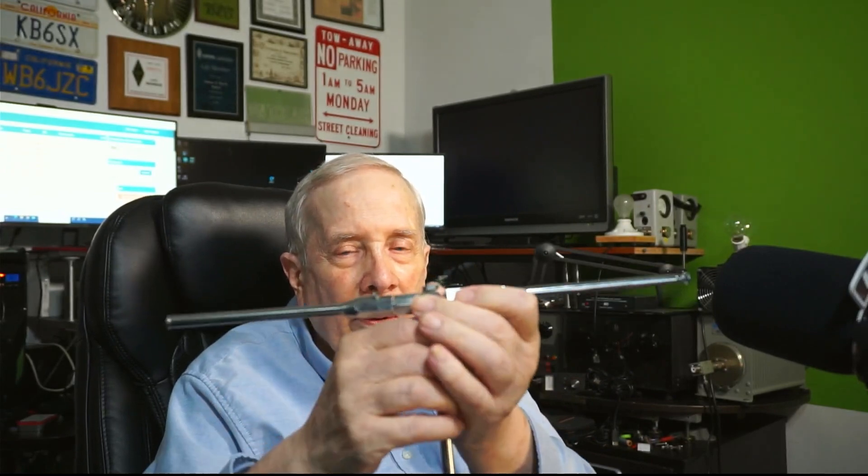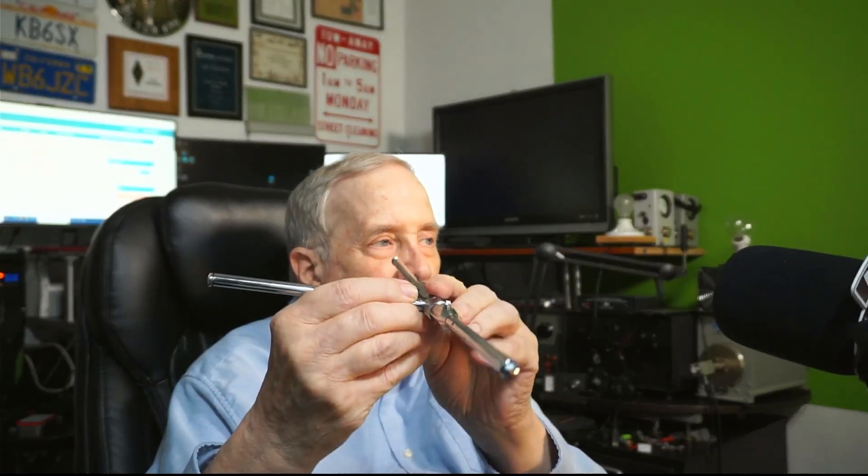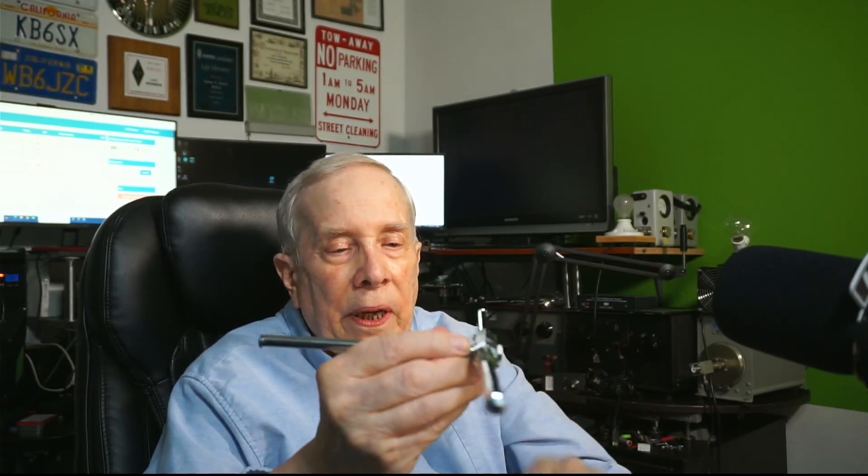What do I have up in the air? I've got basically a dipole mounted on a boom. There are three elements — they look just like this. So this is a three-element Yagi. The feed point would be in the middle, so there's the driven element, the director, and the reflector. As you move the driven element close to the reflector, the impedance changes. It also changes with its height above ground. It's a very effective antenna because you can turn it and point it towards somebody. If you put loading coils near the center, you'll lose efficiency of the antenna.